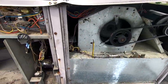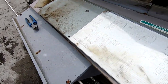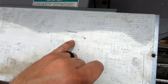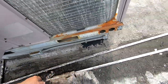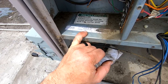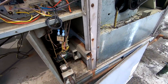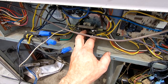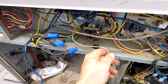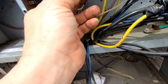Our R wire is going over there, but R is not where our short was. If you wanted to, you could unhook the economizer's R terminal — which powers the economizer control — just eliminating the possibility of another future short. But like I said, this thing is an '07, so it's 13 years old already. Surprisingly the heat exchanger looks like it's still okay — I have to double-check it yet. I'm probably going to go ahead and change this contactor — it's the original one, it's a little sticky, and there's always a possibility the coil is getting a short in it too.